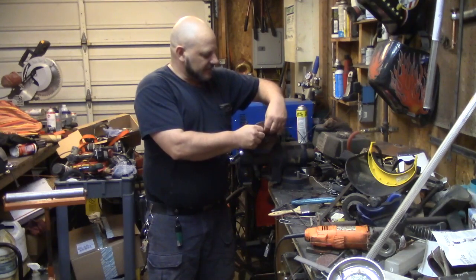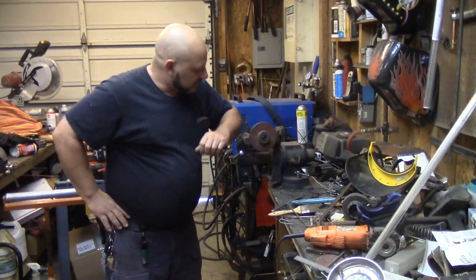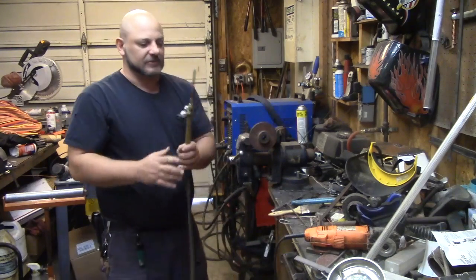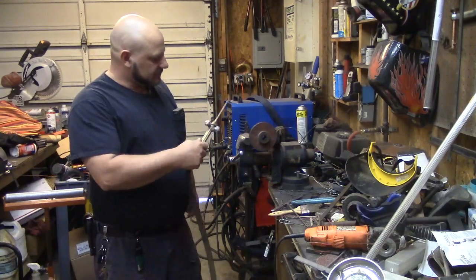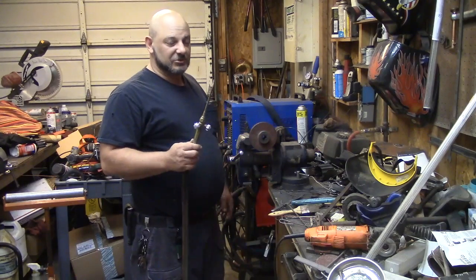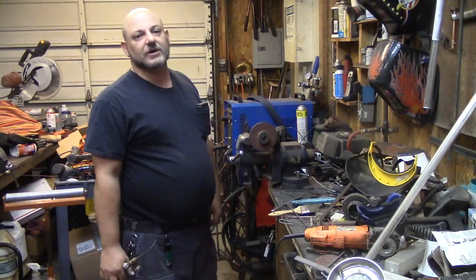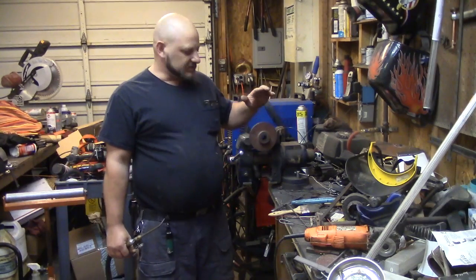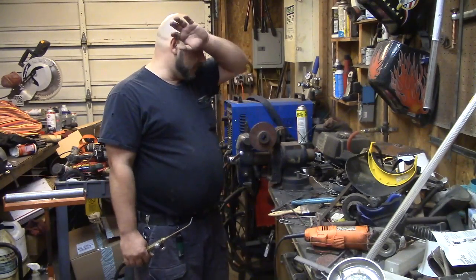So I guess I have a couple of options. Now, I've been doing a little looking up on it, and I only have one of these crappy little Victor Portapack torches, and I'm not going to have a whole lot of gas to work on this. So it's preheating this as good as I can, and maybe try silver soldering it. From what I've seen, silver solder I haven't gotten a clear answer on, but I would think that it would wick better into the original break, because it doesn't have to be a high strength repair, it just has to hold the belt on the pulley.